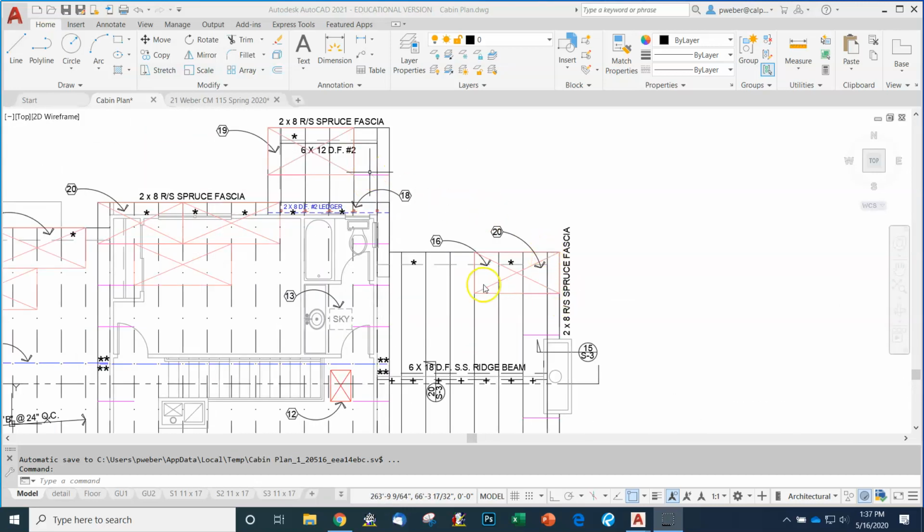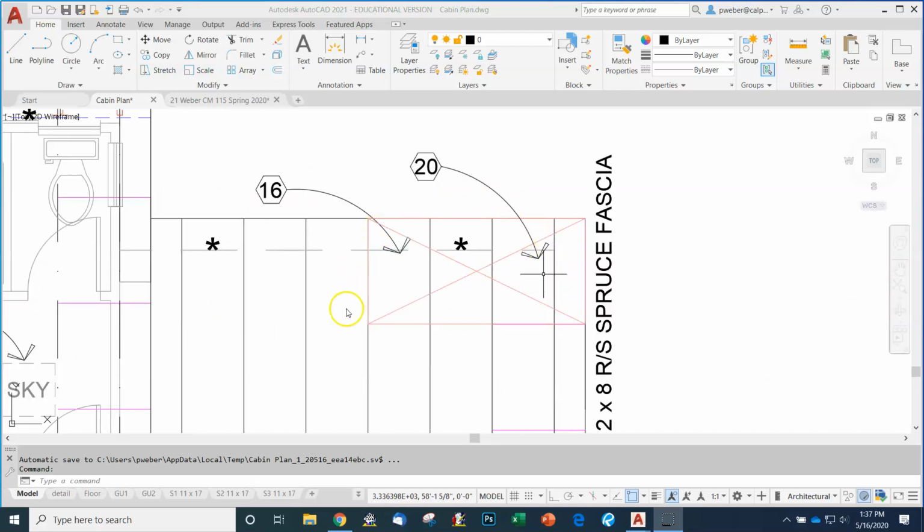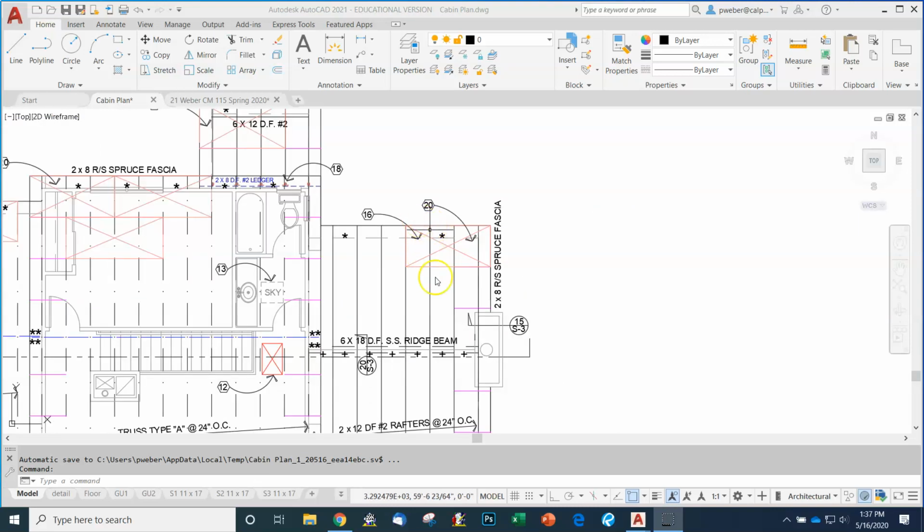And then the plywood, what you should do, this is a 4x8 sheet of plywood, and 1 foot of it gets cut off and tossed out. This piece of plywood is on an 8/12 slope. So this red line here, don't offset it 4 foot, offset it 40 inches. And that's a foreshortened length of a 4x8 sheet of plywood.